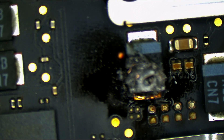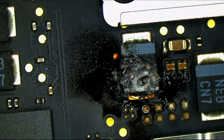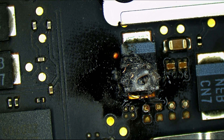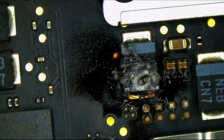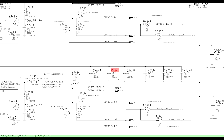This is something really interesting about these machines. The A1706 in particular — a lot of the dead boards at this point are not really water damage, they're just failed capacitors. And look at this. This cap here is labeled PP Bus S5 CPU. It's a polymer tantalum — 33 microfarad, 16 volt tantalum polymer. This cap is rated for 16 volts, and PP bus on this machine is 12 volts. And there's no water damage here.